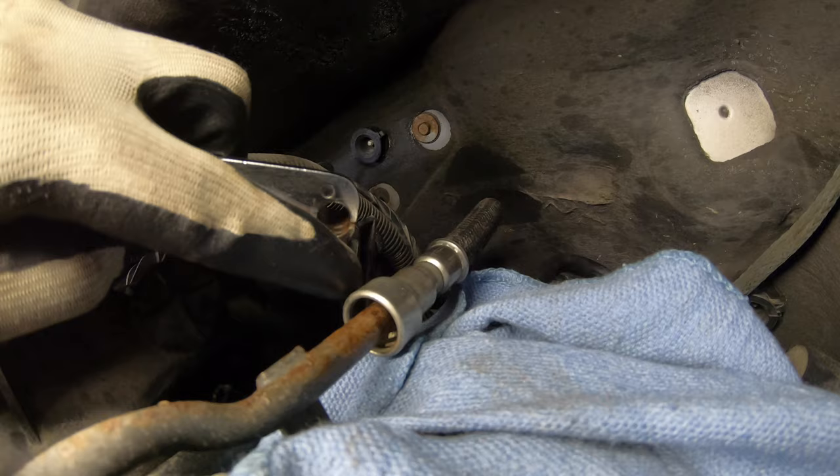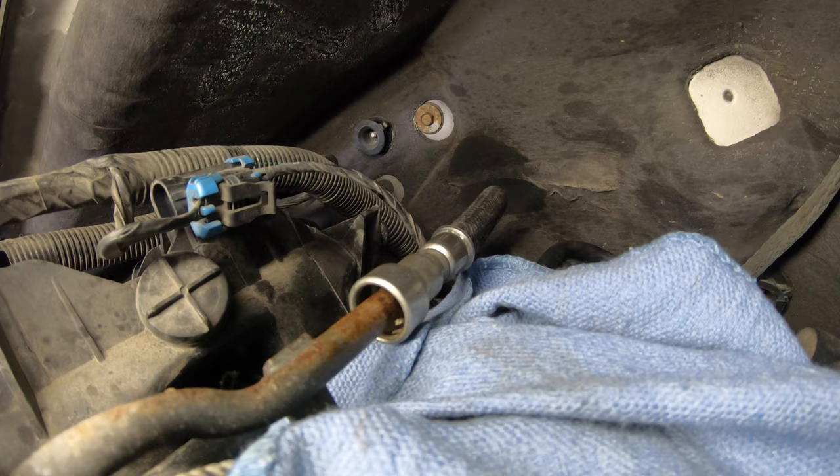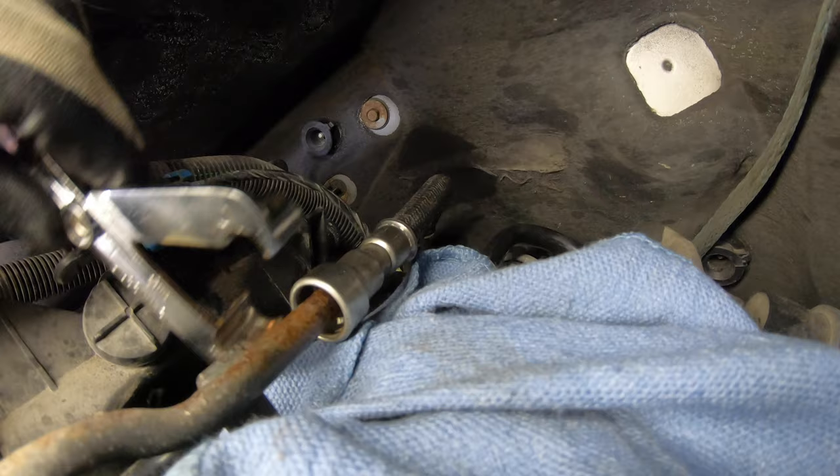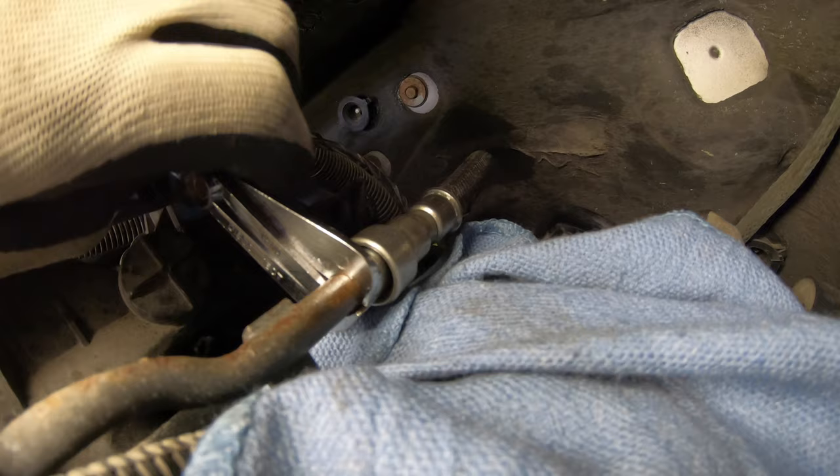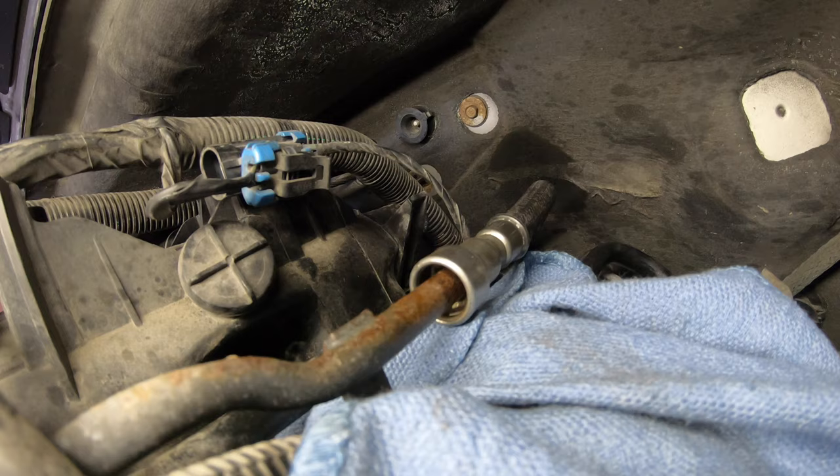Here's the problem, and this is why you're frustrated. You're pushing on this thing and nothing's happening. You're pushing like crazy and nothing's happening — I'm pushing a lot of force on this thing right now and nothing's happening. Why? Because the barbs are right up against the lip, and you can't push them down because they're catching on that lip.